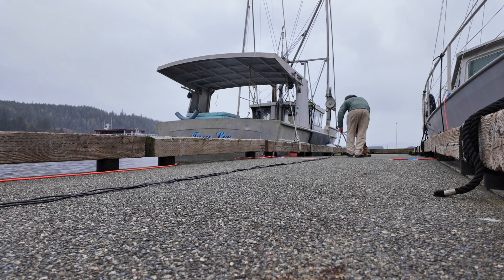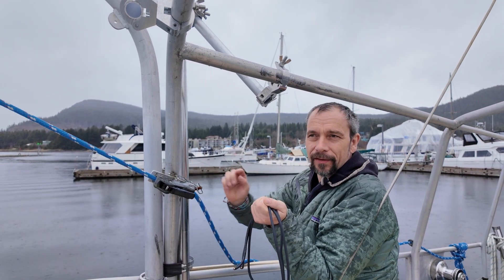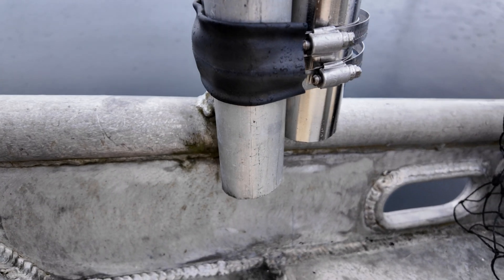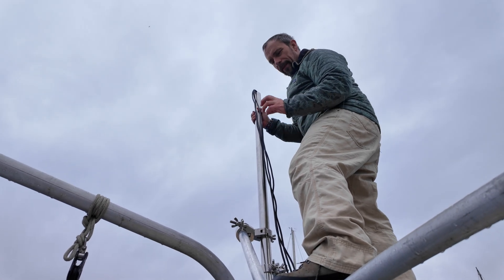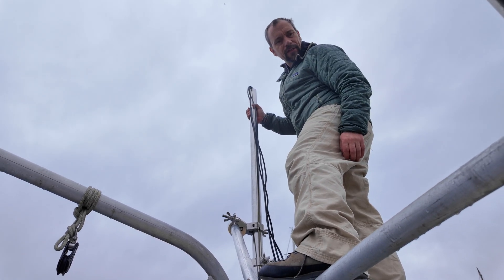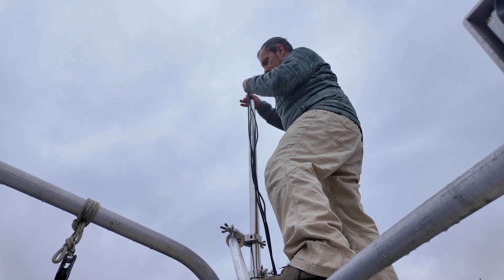There's three. It's started raining now — Southeast Alaska. But we have to feed the cable through this pole and then get it inside the cabin so we can connect the charge controller. Where these two poles connect together and are screwed together, there's a larger lip in there and the cables don't want to go past there. So we might have to drop something with a lead — a messenger line — to pull the cable through.